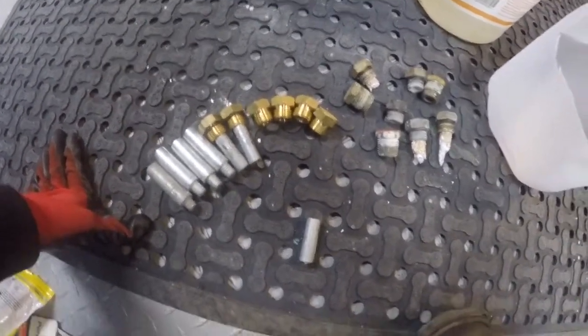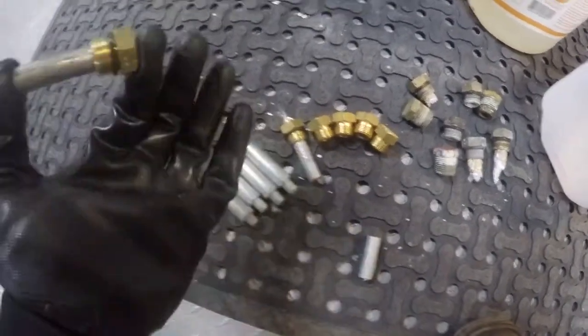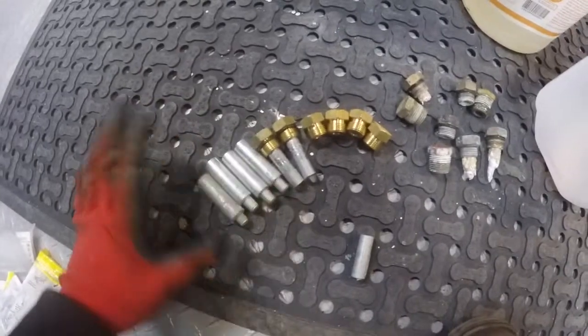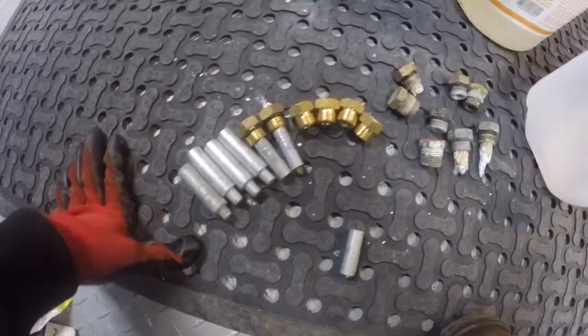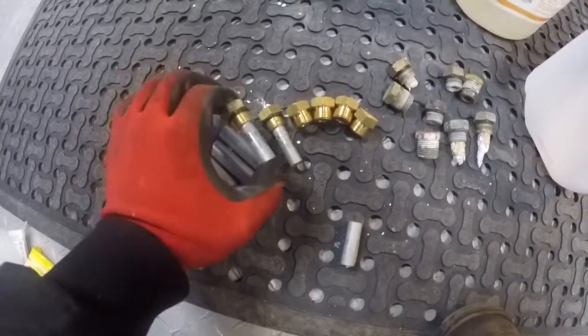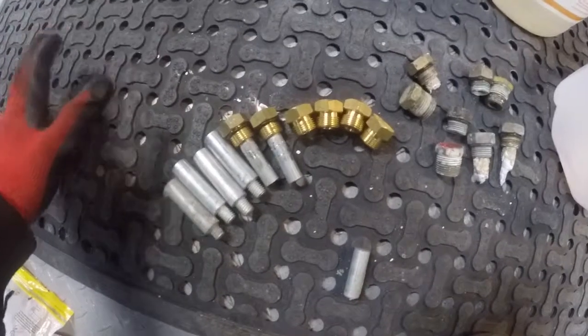For instance, coming directly off of the raw water pump. Your engine may have these scattered all throughout. What these zincs do is they protect other metals inside your engine, and once this zinc wears, your engine metals become more susceptible to wear.